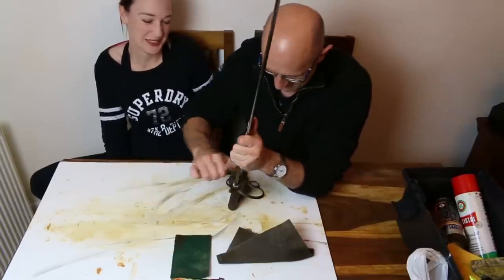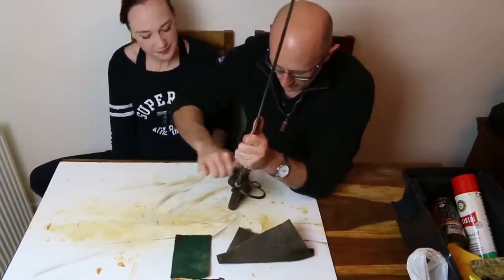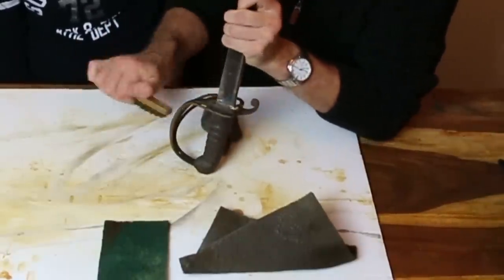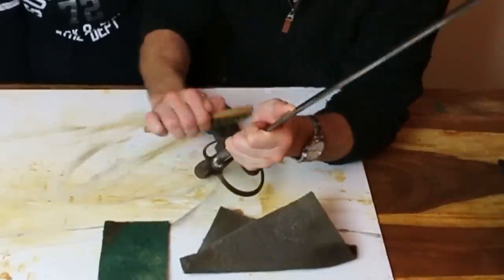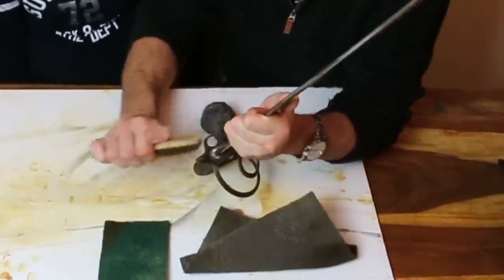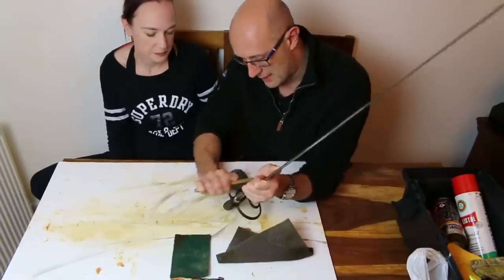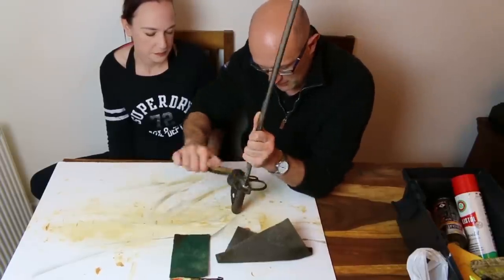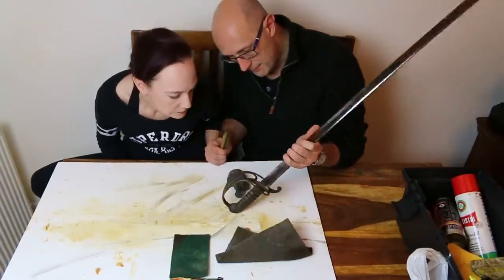Elbows well close to my face. Yeah, gunpowder is very corrosive to steel, which is why when you look at antique firearms, you'll often find they have more pitting near the muzzle and around the breech, if it is a breech loader, because those are the areas where you get the most residue build-up from shooting. So that's actually cleaning off really well, isn't it?